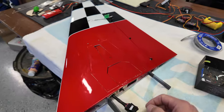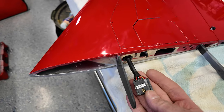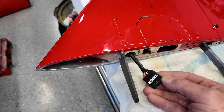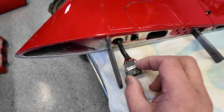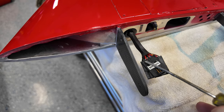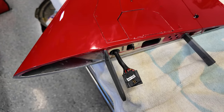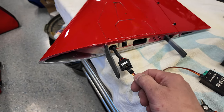We have a little bit of adjustments left to do, but one of the important things I finished was the wiring on the wings. We've got all of our servos on one nine-pin Ashlock connector, and we've got our brake and gear on the other one. The reason I spaced these guys out — we've got black, space, red, black, space, red — is so we can operate this landing gear with a manual controller.